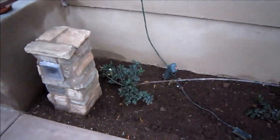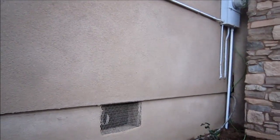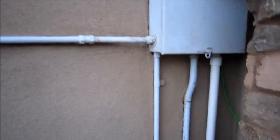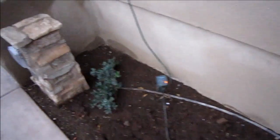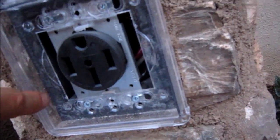Almost forgot — one more note: if you don't feel comfortable or you're not sure what you're doing, just hire an electrician. Don't risk it. I've linked some videos that really explain how your breaker box works and how grounding works. If that makes you more confident, you can try it yourself, but you really have to understand how the whole thing works and what connects to what. In the outlet you have ground, positive, positive, and neutral — that's why there are four wires.